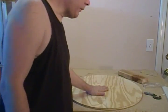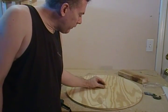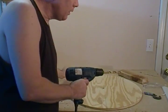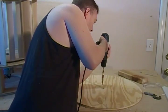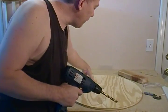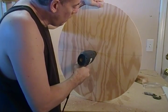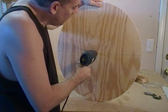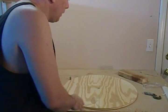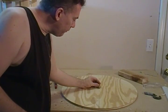This is our lid and we need to press our bronze sleeve into it. What we're going to do is open up this hole with a thirty-one sixty-fourths drill for the top — just be really gentle and open it up with the thirty-one sixty-fourths drill. Then we're going to press our sleeve into that.